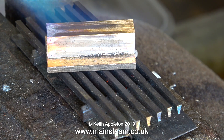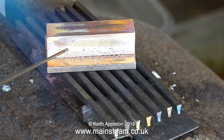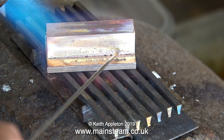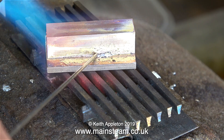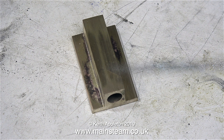As you watch the silver soldering operation — as always I wait until the flux takes on a watery appearance before I apply the silver solder. As I apply the silver solder you can see that the brass block moves on the brass plate, but while the silver solder is in the molten state it's very simple to move the piece of brass back into position. After allowing the part to cool to black I quenched it in water. After cleaning it up on my one-inch belt sander I'll put this part in the acid bath to clean off the flux residue.